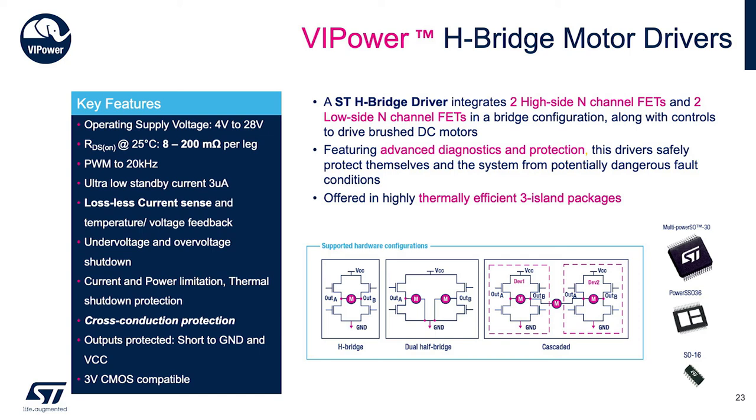have very, very low standby current, in the range of 3 microamps. And most importantly, lossless current sense, as I mentioned to you when I was talking about the high side drivers, is a built-in feature called current mirroring that allows you to identify the current through the high side drivers of these H-bridge drivers, allowing you to perform torque or speed control of your motor very, very effectively with high accuracy. There is also the same current and power limitation that you would come to expect of